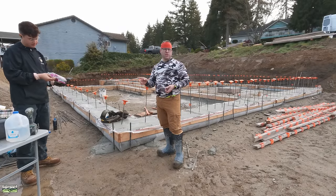Okay, so we're an 8-inch wall. As I mentioned in the last video, we should have had the rebar caps — well, we got the rebar caps now and they're always bouncing off the GoPro. Safety first, people. We're just tacking the cleats in place with 16-penny duplex nails — we call them dupes, 16 dupes. We're not actually going to use these on our foundation forms anymore; we use screws, and I'll show you that in a future video. For now, we're just going to go ahead and use them up by tacking into the concrete, getting about one to two inches in.